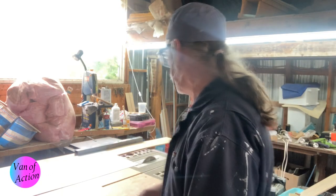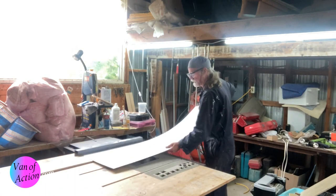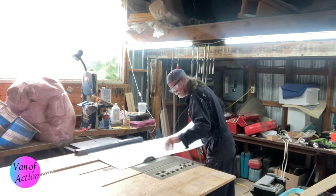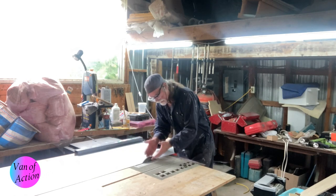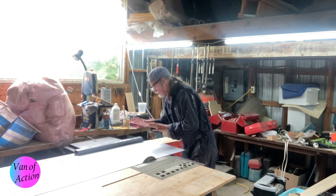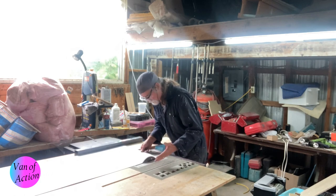The second thing I wanted to mention: as I'm pushing it through, I'm not looking at the saw blade. For long pieces when you're pushing through the fence, focus on the fence and make sure you've got good contact the whole length of the fence — don't even think about the blade. You're watching here — this is where the trouble occurs. If the saw blade binds, it's because you're not up against the fence properly. For long sheets, always always always watch your fence. Then when you get to the end, make sure you're not going to cut your fingers off.